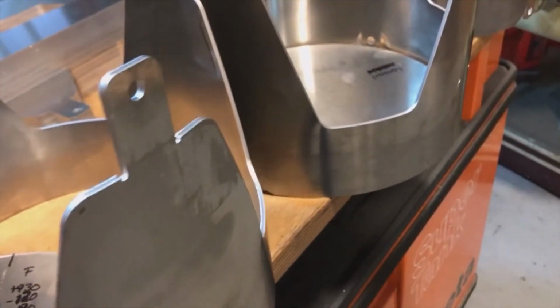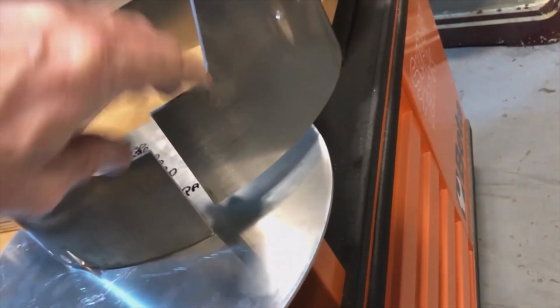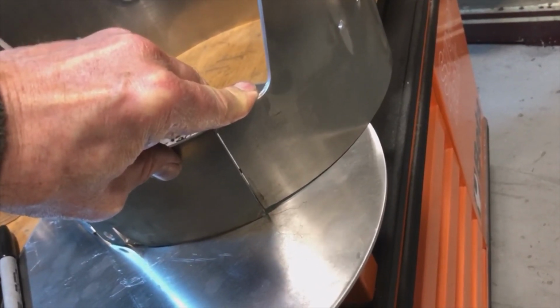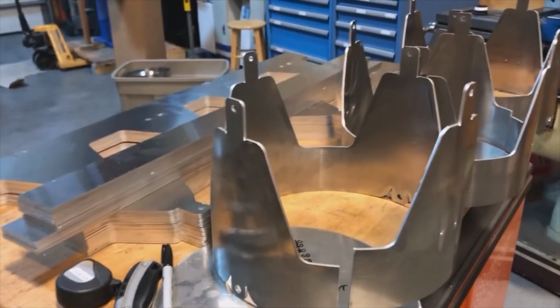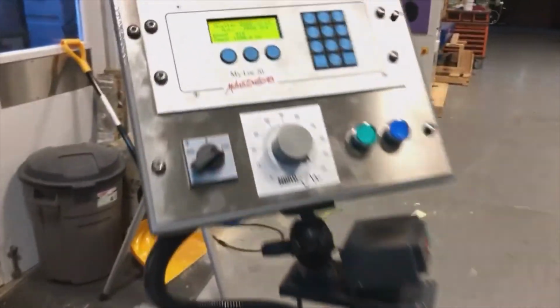Maybe I'll roll one more and we could even give it a tad more, just close it up a little bit more. I'm never sure with customers whether they prefer to have the parts a little bit open or whether they prefer to have the parts more closed. That depends on your welding process and how you clamp your parts. Of course, that we can quickly control by changing just some values. Okay, for now I will try to close that up a little bit more.